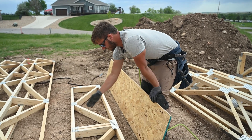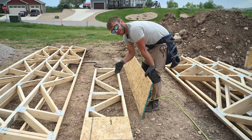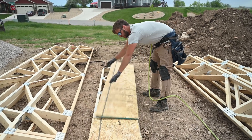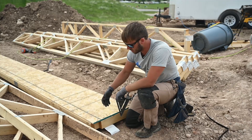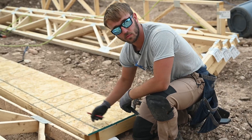On this one right here, we have a relief cut that we need to make. When we make that cut, we might have to bring that circular saw down this joint to allow the truss to set down on the wall. The last thing we're going to do is cut it on the ends and put this notch in it so we can run our rim board.